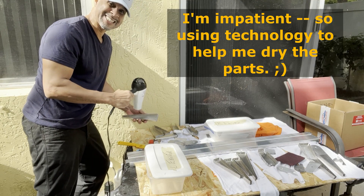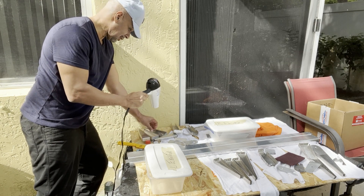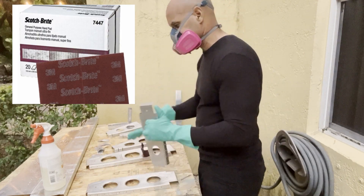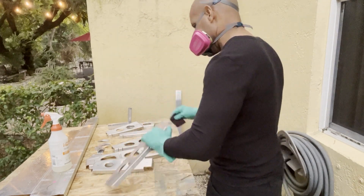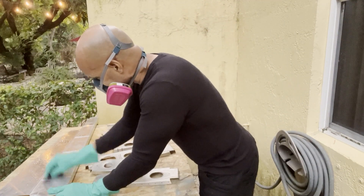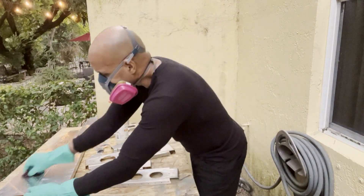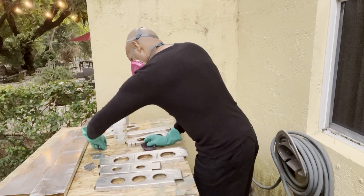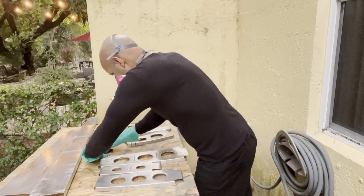But wait, there's more prep work to be done. In addition to all the hyper-cleansing, we must scuff off every surface that we intend to prime with a scuffing pad like Scotch-Brite — the maroon colored version. Primer doesn't like to stick to shiny metal, so we need to do all that we can to help it out, and one of those things is helping the metal lose its slickness. So here I am scuffing the contact surfaces of the elevator ribs to get the shine off. It's a pretty easy task, but it's so time consuming.